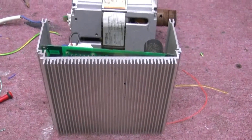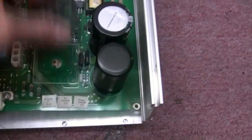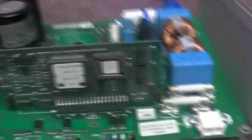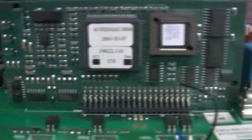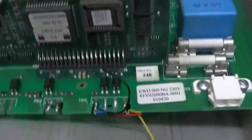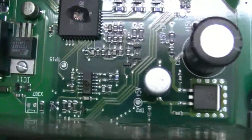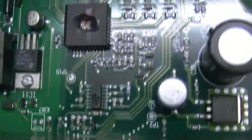This is one of the inverters which pissed me off. There's the IGBT driver — it didn't take long to pop that. There's so much communication-on-board technology that it needs another board and a computer just to get that motor to run at decent frequencies. Something popped there: as soon as I got to my target speed and tried to increase it, you get a typical chain reaction and everything goes pop. That inverter was probably about 600 quid — absolutely ruined.